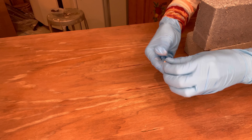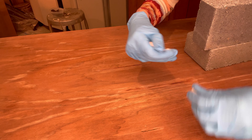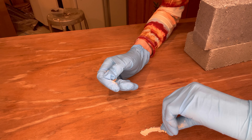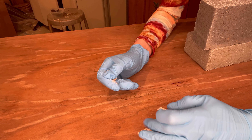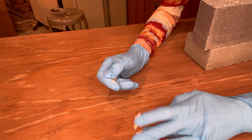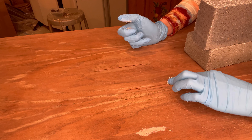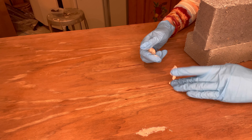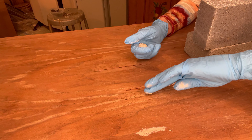Here's the first little crater — I'm putting it in right here with my pinky. This veneer, once it split open, is so dry. There's a big section right here where it's split — I'm trying to push the quick wood in, really get it in there. My decision will be made once I see how this sands flat or not. Sometimes that's just what you've got to do — try something, see if it works, and if it doesn't, hopefully you learn something from it.